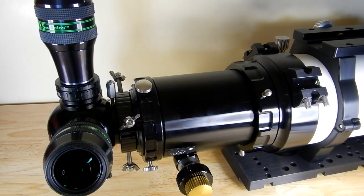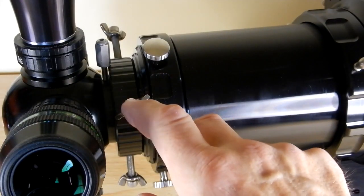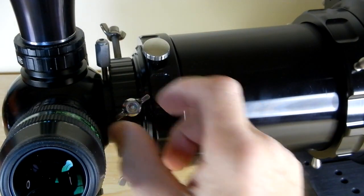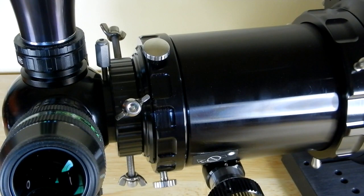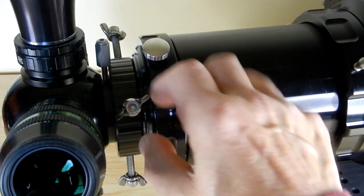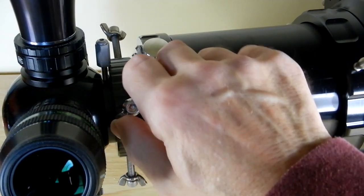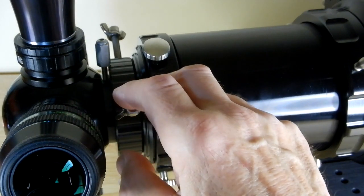And the total cost, each bolt, each 1/4 28 by 2 inch socket headed cap screw, was 77 cents, and the 1/4 28 wing nut was 30 cents a piece, and they are stainless steel. And I like these much better because they have a better gripping here with the wider stance of the wing nut, plus they're further out than what the one would be from McMaster-Carr. So my hands are nowhere near any of the focuser end, and I can get out fully, and it's not in the way of the eyepiece.